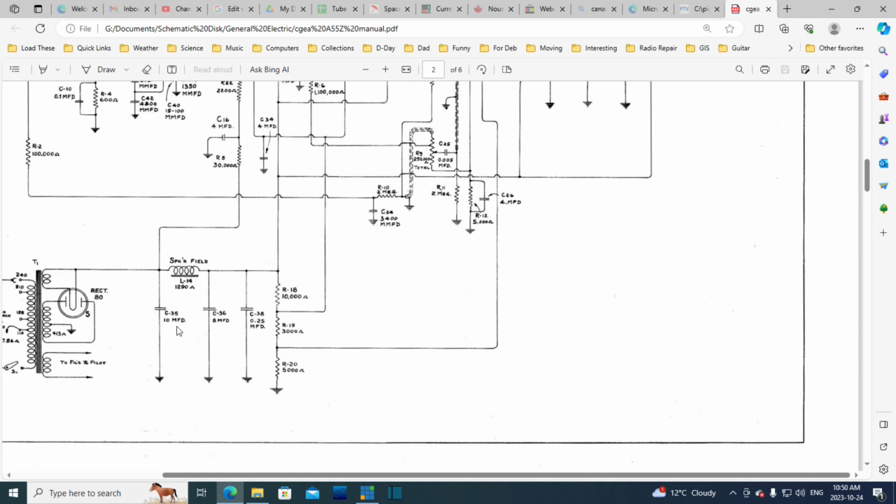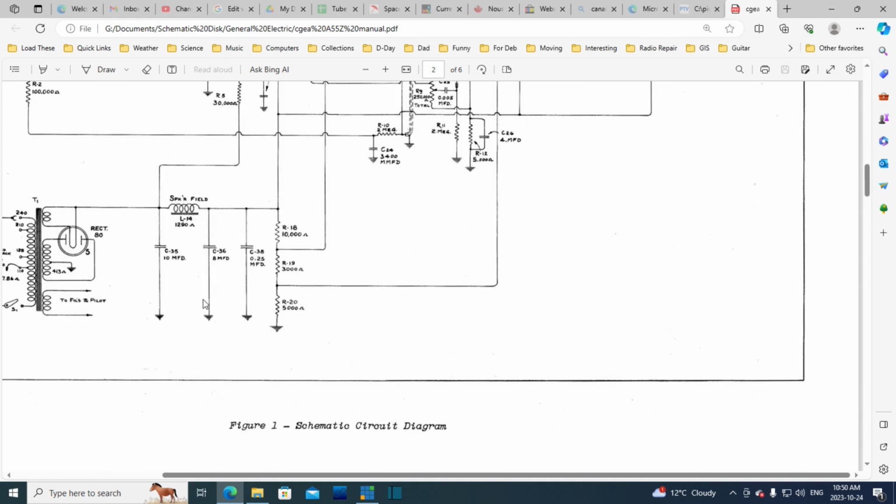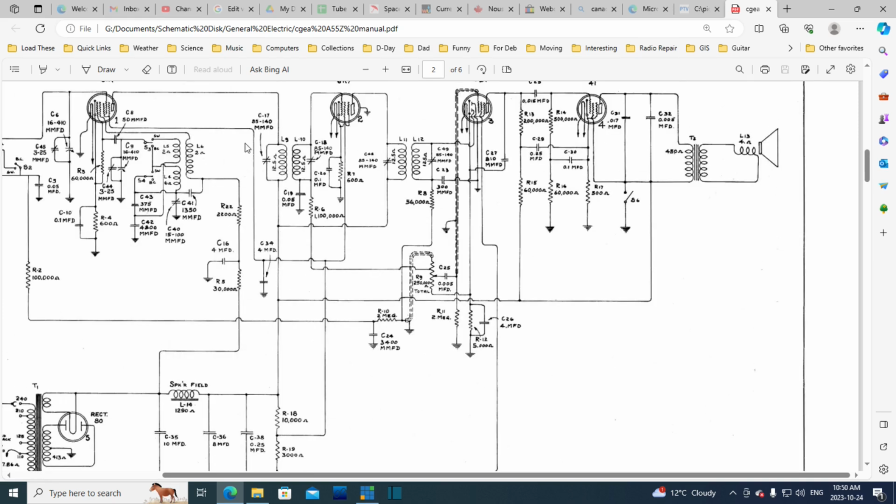So it's possible what someone has done is they've done away with some of the capacitor filtering in the radio in favor of boosting this part of the filtering. They put a 20 in here, and hope the 4 wouldn't be missed, or something like that. I'm just making that part up. Well, there's two 4s right there, a 4 and a 4, on the schematic. They're right next to each other. Is that what's been forsaken? Or he stuck another 4 in. I haven't recognized it yet.